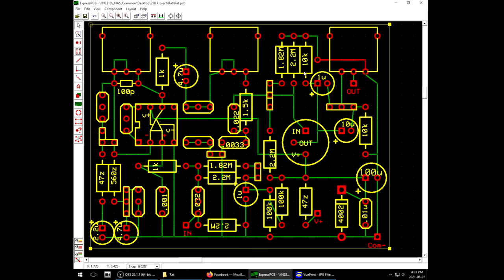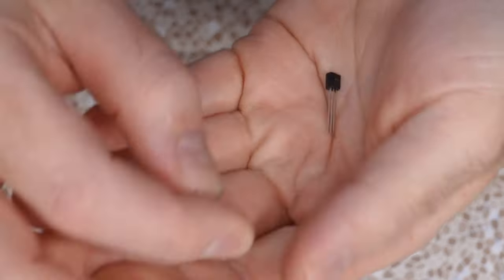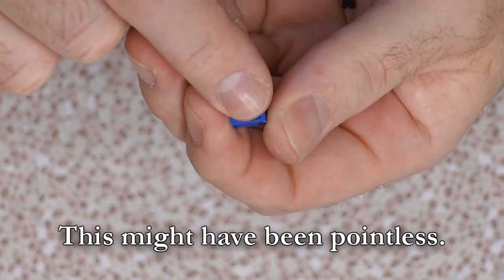I am thinking that the 10K source resistor here is the closest we're gonna get to setting the bias of this pupper. So that's pretty much just going to be the key to making it work if I can tweak on that source. So I'm thinking of replacing that 10K with a nice, I got a 20K potentiometer here.